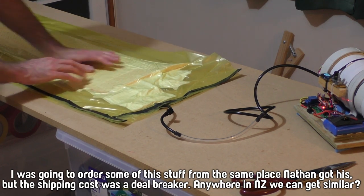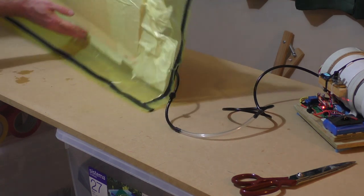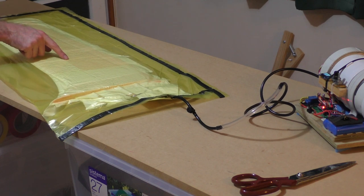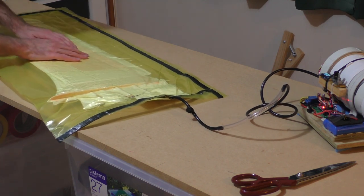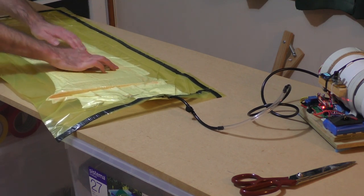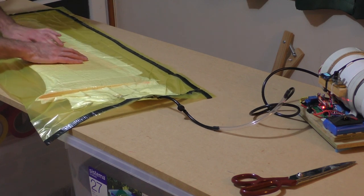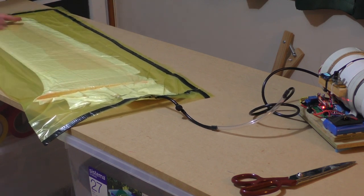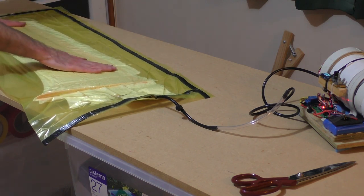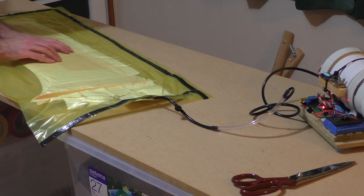See if I can avoid that problem I had yesterday where I got crinkles like this in the bottom. See these? That's going to end up in a crinkle. I ignored it yesterday because I didn't think it would be a problem, but it seems like it is. But what can I do about it? See, if I just do this, they come back. That might be avoided if I had more breather cloth on here. I've only got one layer, which is pretty thin. But there wasn't much resin in there, so it's not like it was necessary.